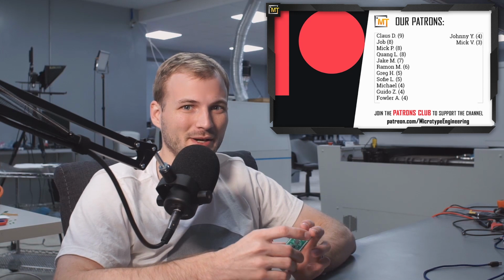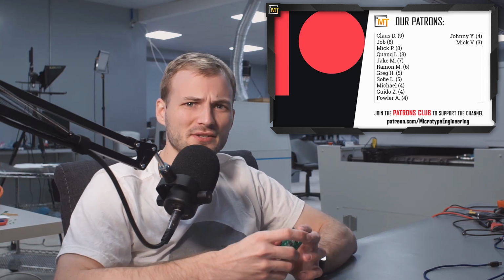So this project actually will be completed, unlike a lot of my others. But it's basically just going to be a simple evaluation board, nothing too special, just with an I2C interface and a USB-C input. I am going to do a couple things that you don't see a lot of times in hobby level or YouTube tutorial videos, and that is it's going to be a 4-layer board, and instead of just using a crystal for the microcontroller's clock, I'm going to use a powered oscillator. And I'll explain the thinking behind that when we get into the video more. But with that all said, let's jump into it.